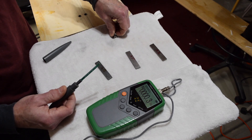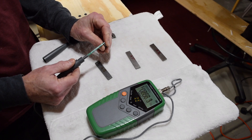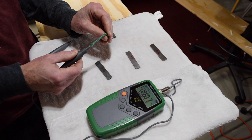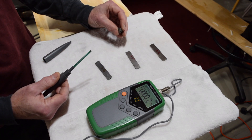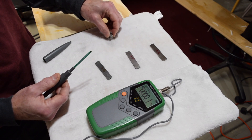With a slug magnet, it's basically the same type of measurement. We can see that this Alnico 5 slug magnet, fully charged, has a measurement of around 875 to 880 Gauss. So this is going to yield a pickup with some pretty decent brightness to it.